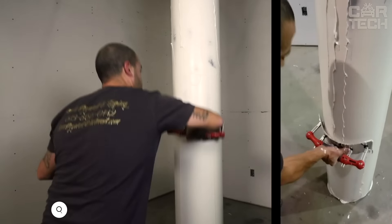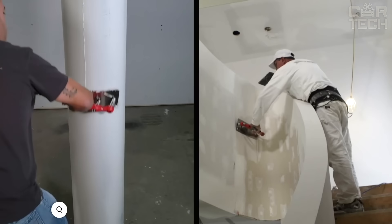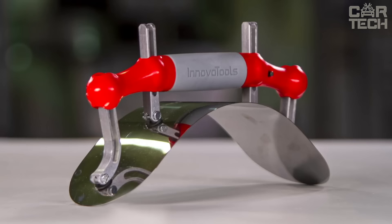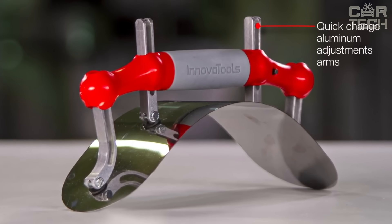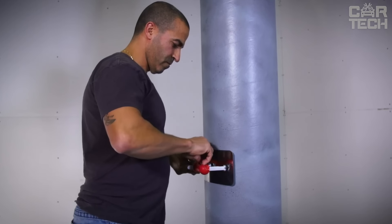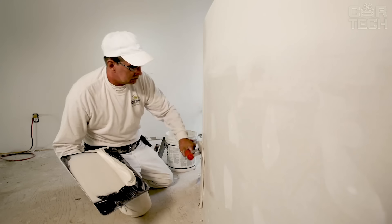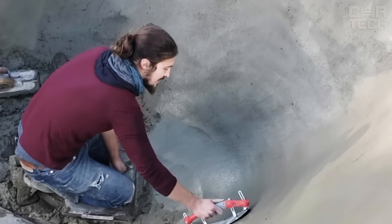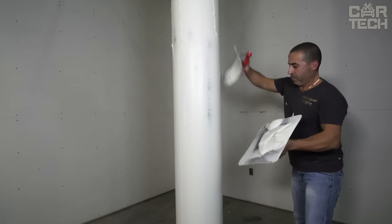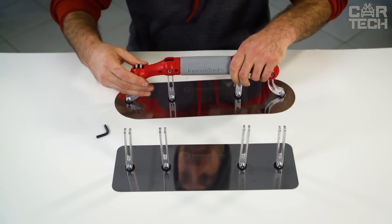The Multi-Trowel Adjustable Trowel is a godsend for those who work on uneven surfaces. It will help you perfectly level a dome or rounded wall. It has a 16-inch long steel blade with rounded corners, allowing it to perfectly adjust to any surface shape. Stainless steel for the blade, aluminum for the adjusters, and the handle is fiberglass-reinforced plastic with a marine-grade vinyl grip. It can handle drywall, plaster, concrete, shotcrete, and any material. In maximum bent position you get an 8-inch radius, convex gives a 10-inch radius, and turning the handle gives a 5.5-inch radius.